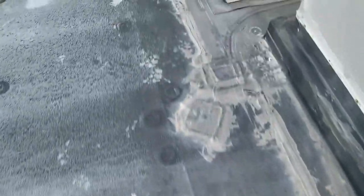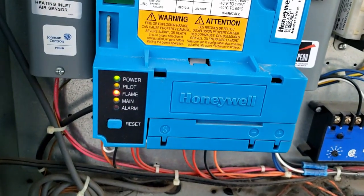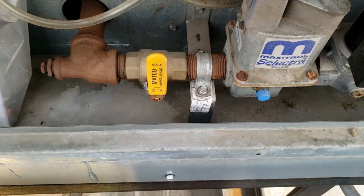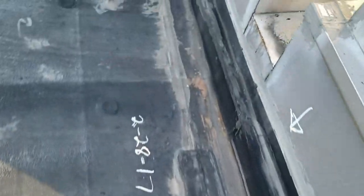What we can do is turn the main burner gas off, which will leave just the pilot gas flowing — at least that's how the ones I've worked on before have been. We still have a pilot flame but the main burner gas is off because it's coming in through the pilot system, and that can be adjusted. Looking again — it's not making it all the way across the burner, so we need to go ahead and do some cleanup here and shut her down.